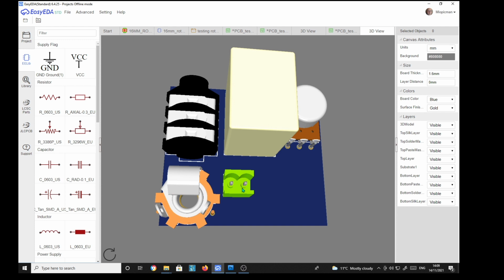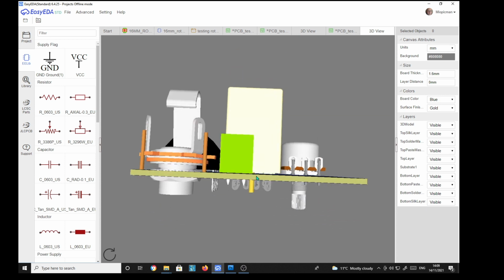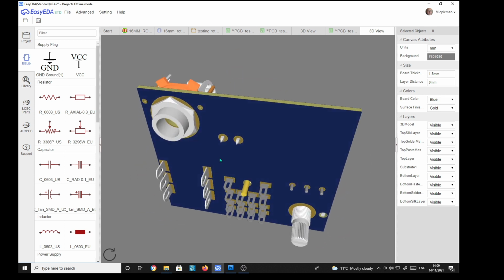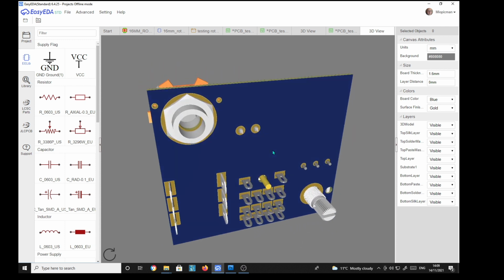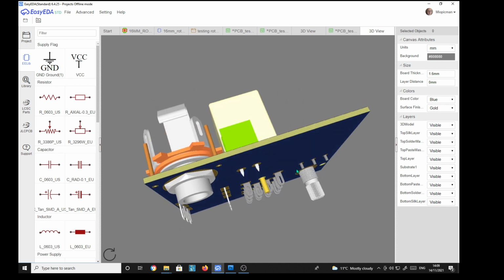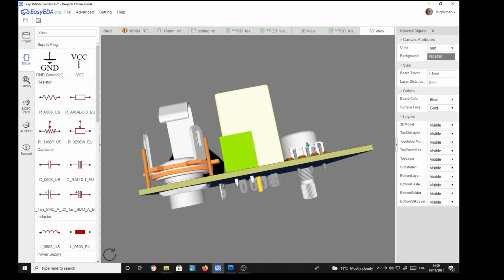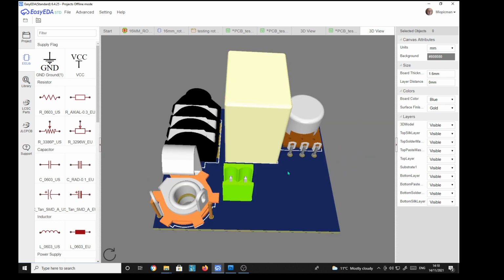This is a conventional PCB mount socket. This is a stereo switch socket with normal solder tags on, and I've made slotted holes for it. And also a relay here with ordinary solder tags, which I've made PCB mounting. This one is a 4-pole 24 volt relay.